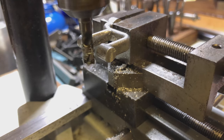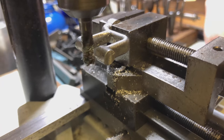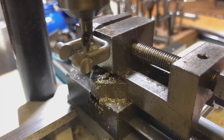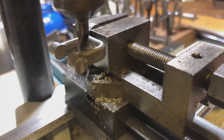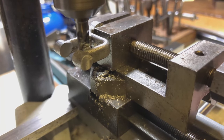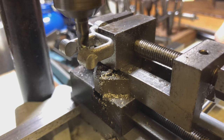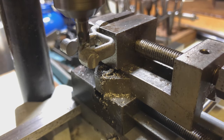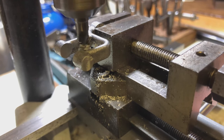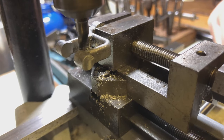Let's bring this across, bring this in, turn it on, bring it in and wind back until — there's the touch off. I've just realised this is going to be climb milling, but actually no — I'm an idiot, let me come away from it, come in past the boss, there we go. I'm not a complete loony. Tight quarters again. Let's take the slack out, bring this across — yep, it's touching. Let's bring it towards me and give her a cut.